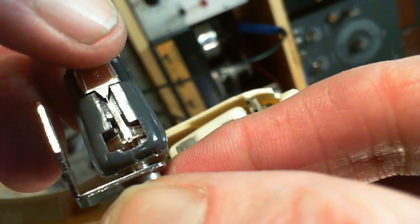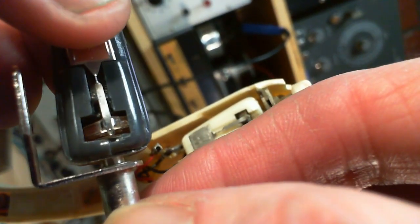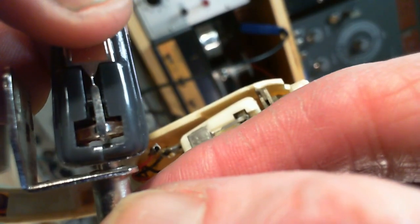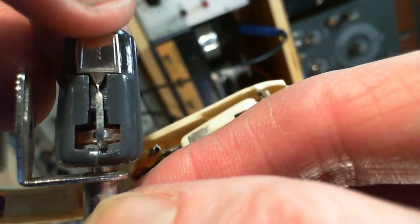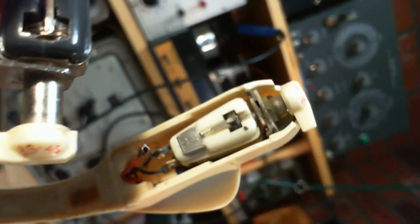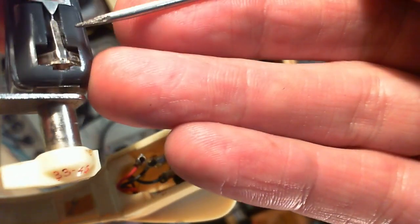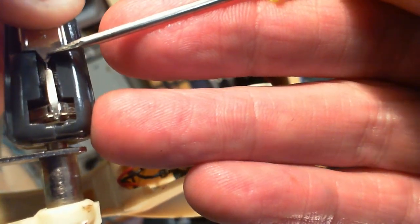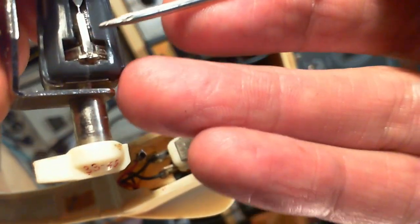Doesn't look off-center up here. Maybe we can't see it for real. I mean, if I lift that needle up, the piece below is going to pop over. Is it straining the needle? It does seem to be bending the needle a little bit. The way they designed the needle, by the way, it needs to be relatively stiff, but it has to bend somewhere, so that's the bending area right in there, where this part can flex.